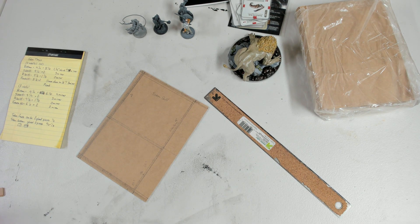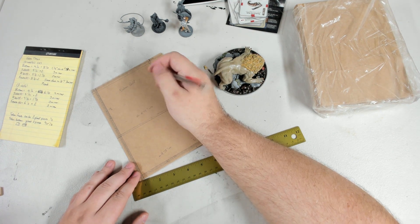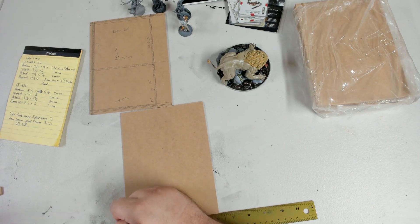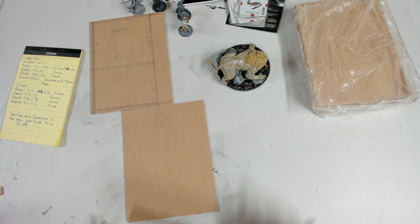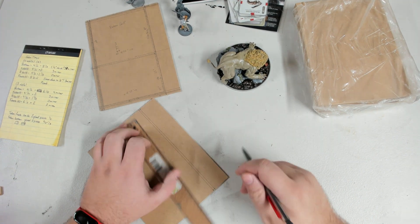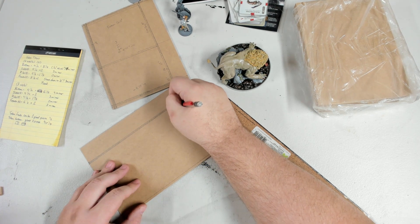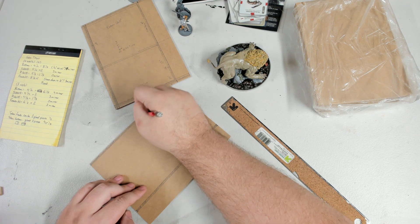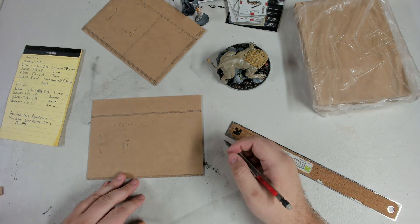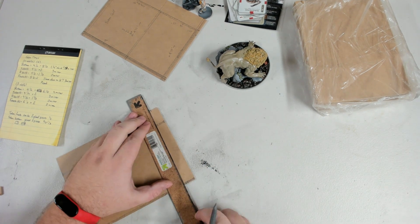The bottom is pretty strong, the bottom is where the cards will be. That makes the top part accessible — I can pull the models out easy. Three sides will have a miter; one will not. I like keeping one straight side, and that allows me to make everything referenced off that straight cut. I'm going to assume the manufacturer made straight cuts and that my cuts are wonky, so I try to maintain as many manufacturer cuts and edges as possible to keep the rest of it nice and straight.